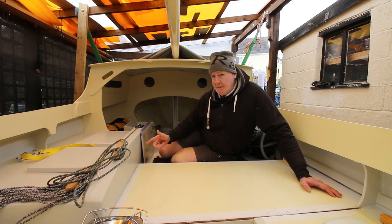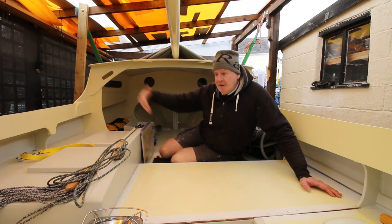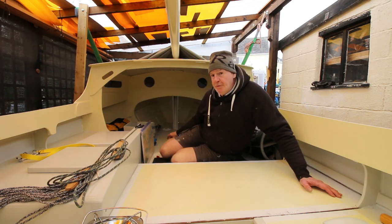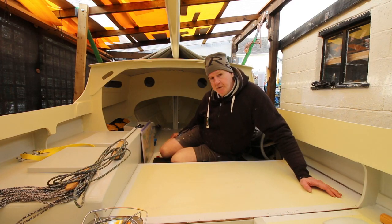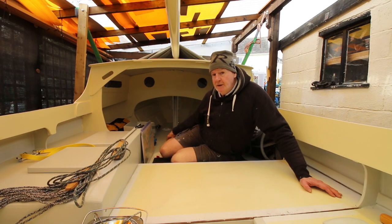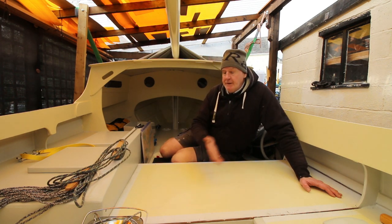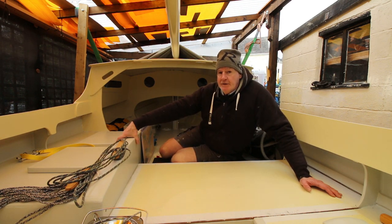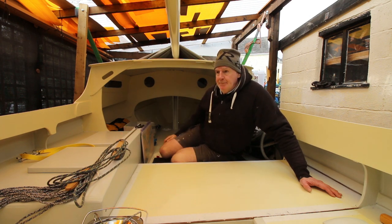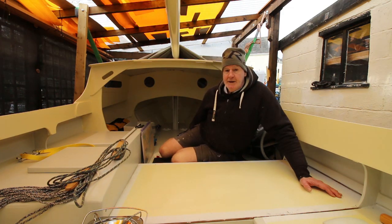So for example, it could be a daggerboard, which is a vertical sliding board, or leeboards, which swing on the side of the boat. And one thing I was very, very tempted to do very early on, when I was working on what to do with the construction, was perhaps to do leeboards, which I'm familiar with from Thames barges and Dutch yachts, because then the centre of the boat is completely free of any structure like this.